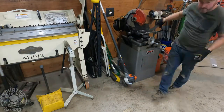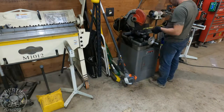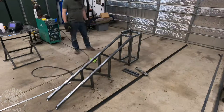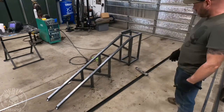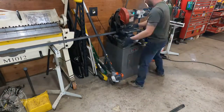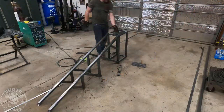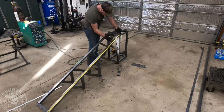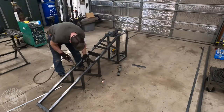You're noticing that all my triangles are open face on the ground - I'm not putting a tube along the ground, and I did that on purpose. Since we are taking this out in the field, I don't want a brace going along the ground making those complete triangles. We have our vertical support so as the car pushes down it distributes into that triangle. But I didn't want to connect the tips of the triangles on the ground in case the ground isn't perfectly even - I want the ramp to be able to flex a little bit. Otherwise as you're pulling up it, it's going to be teetering on the uneven ground. The other option would be to make those solid and then put adjustable feet down to accommodate for uneven ground.